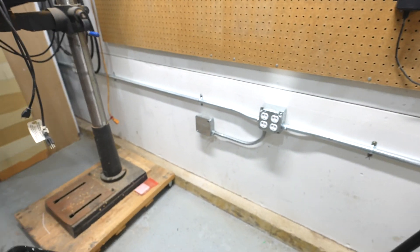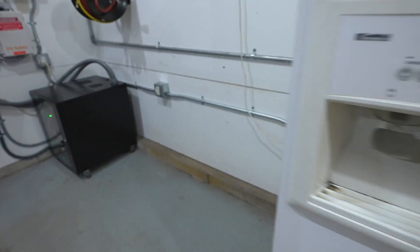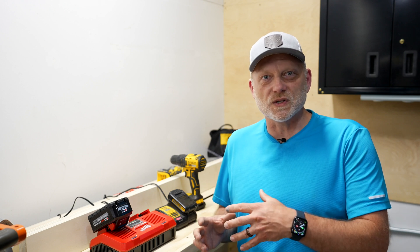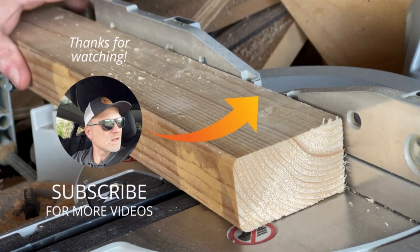The install is now complete. In total I installed nine different outlets on this side of the shop over two circuits directly from the panel box, and that's really going to help me charge tools and run accessories on this side of the shop. I'd like to know what you think — are there things you'd do differently or improvements you'd make from the techniques I used? Please share those in the comment section below to help out other viewers. Thanks for watching, and if you found value in the video, please hit the like button on the way out and we'll catch you in the next one.